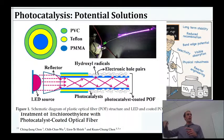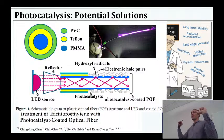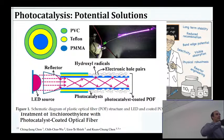They're going to just bounce back and forth until they're meeting the spot where you want them to act, and then you can coil a lot of that fiber optic. You can actually make plastic fiber optics, by the way. So the standard fiber optics is glass, and the cladding makes it not fracture, so it becomes flexible. Like a thin piece of glass will actually be flexible, except without any protection, it'll just crack. Right? But if you give that protection, it can actually bend safely.